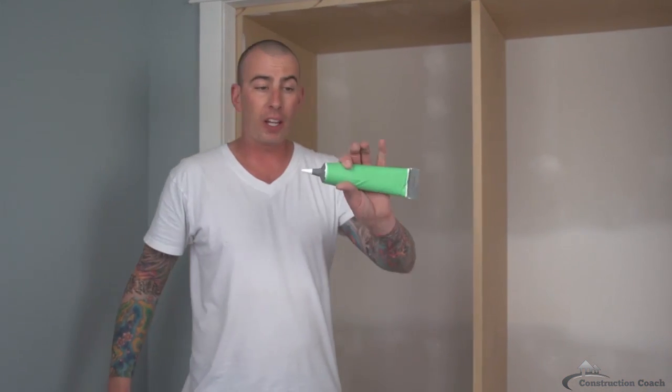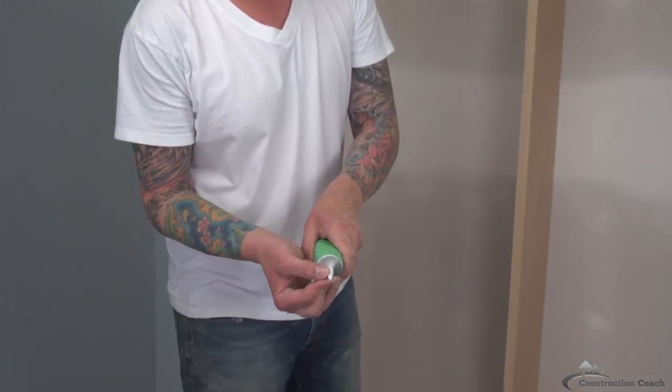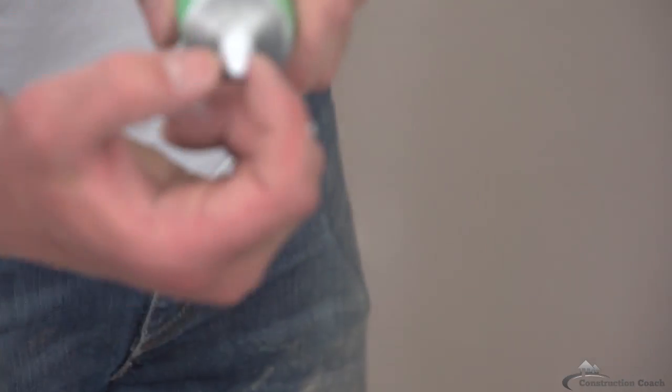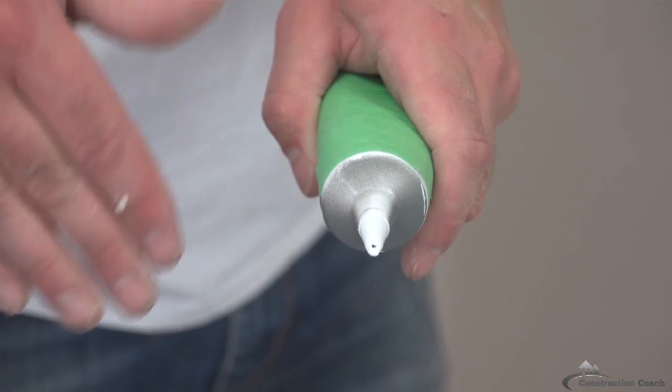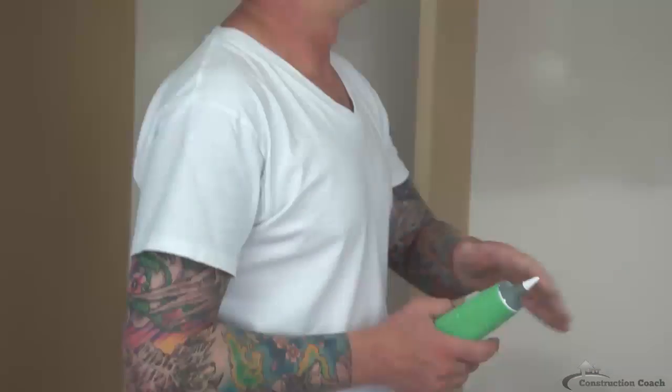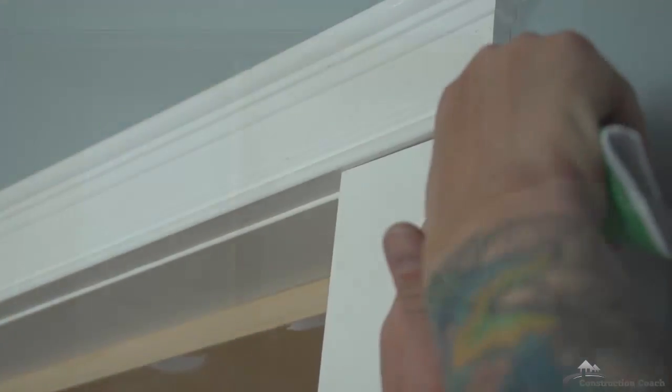Okay, so my caulking comes in a handheld tube. I just make a cut on the front. I usually cut along the sides too, just so it can get tighter into the inside corner. I'm gonna start with the frame and casing first. You can see this bad joint that I had at the start. I'm gonna start with that, with the caulking.